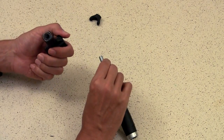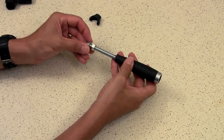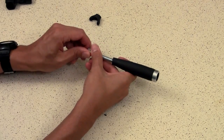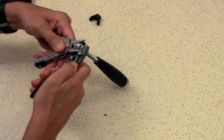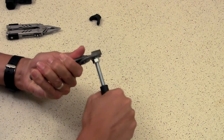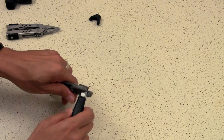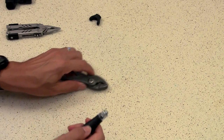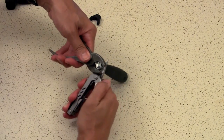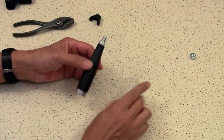I took the two three-eighths inch nuts mentioned in the parts list and attached them to the end of the threaded rod, one at a time, at the very end so they were together. Then I took both pairs of pliers, gripped both nuts, and turned them against each other to tighten them up so they would not move. After that I had a firm place to grip the threaded rod without damaging it. I turned the handle until the threaded rod screwed into the handle until the nuts actually touched the top of the handle. Once that was done, I removed the two nuts, separated them by turning them opposite to how I tightened them until both were loose, then took them both off and put them in my parts bin — their job was done.